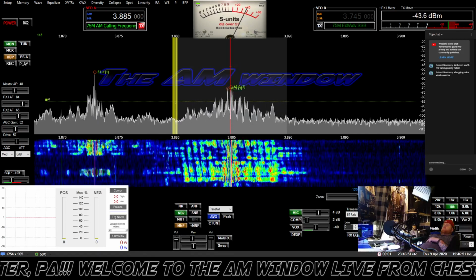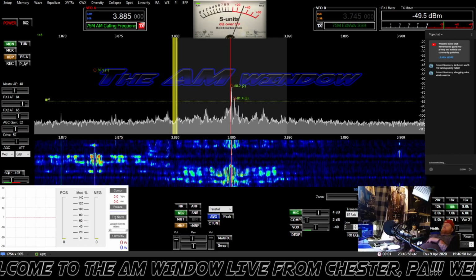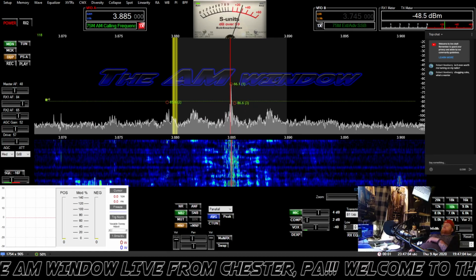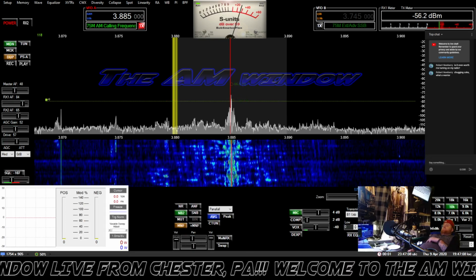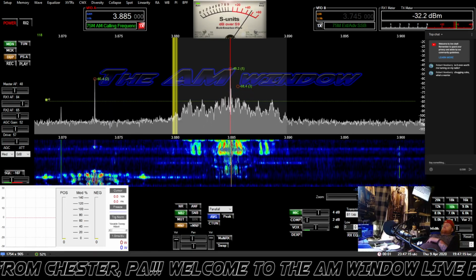Just a variac on the primary of the plate supply, because I don't have a tube modulator in it. Yeah, well, that's what you got there. Well, you know, a style modulator, variac on the plate supply, that's another way of doing it. But the Ranger's got a power transformer. You can't variac it. I sure was worried.